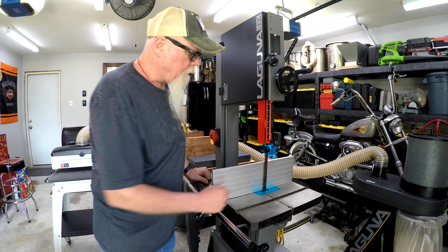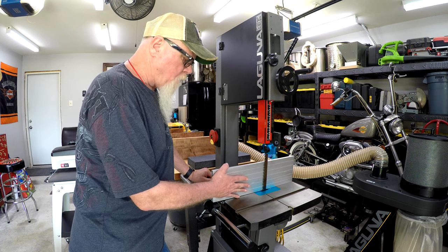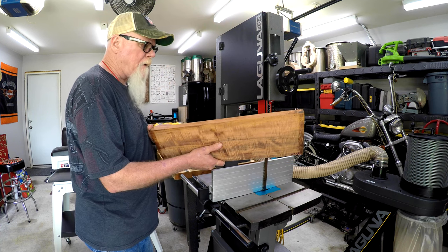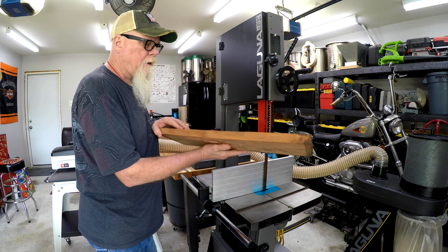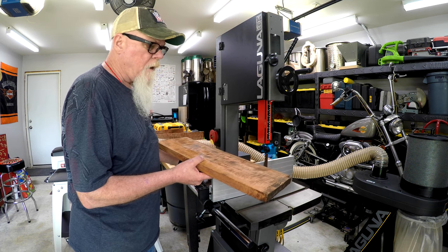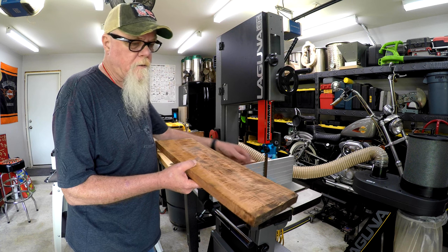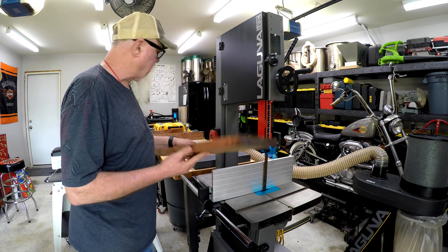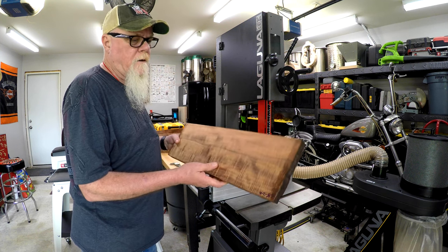Got the three-quarter inch Resaw King installed. Runs very nice and true. I'm at the proper tension and I have the fence set to exactly one eighth of an inch cut. Today I want to cut this koa. I have four pieces and may just do one — right now I need a ukulele back and side set. I have this really nice, highly figured, expensive koa wood. The blade runs about 48 to 50 thou kerf, so that's how much sawdust we're going to leave on every cut. Sometimes I like to sticker the wood, put it back inside, and let it sit until I need it, and I can reinstall the Resaw King and do it again.